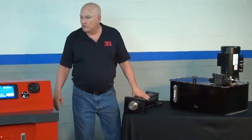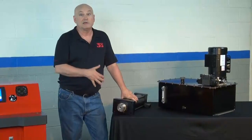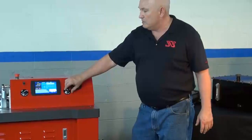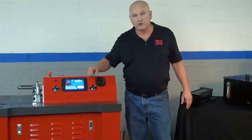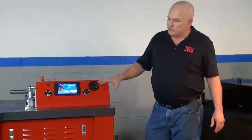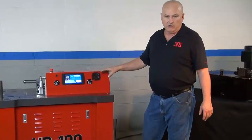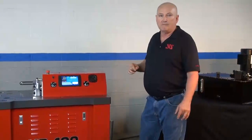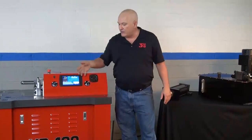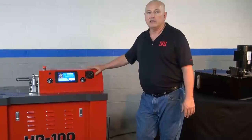That's pretty much it for the hydraulic video. Go check out the other videos and we'll talk about the controller and how we actually make the hydraulics move. Before I go — the motor and the controller have different switches, so we can turn the motor on and off. Part of the safety features: if somebody gets hurt and they hit the e-stop button, you're going to hear a horn go off to notify people in the shop that something's gone wrong. The switch kills power to the motor, which means everything stops right there. Once it resets, the motor comes back on. Please check out our other videos and thank you for considering JD Squared.